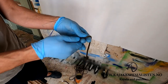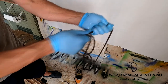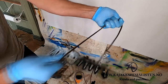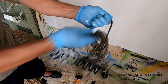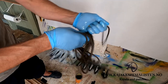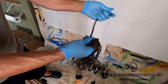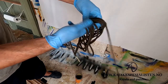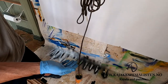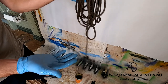It's well soaked now and I just pull it through my fingers. That way I squeeze out the extra varnish and also make sure there are no dry spots — it gets evenly distributed all over the rope. It's nice and sunny outside so I'm going to hang it out to dry in the sun and it will be ready for the rigging job tomorrow.